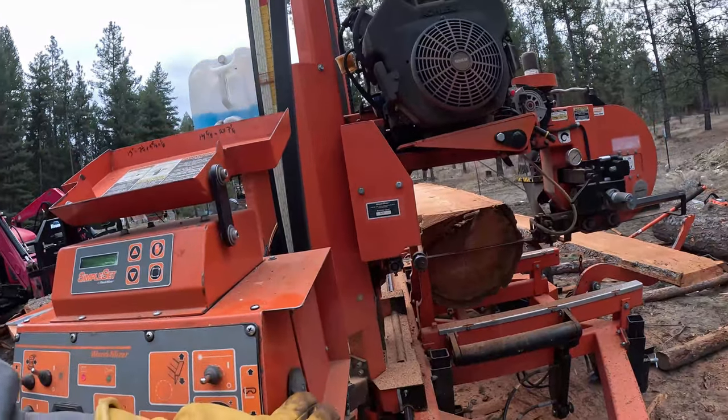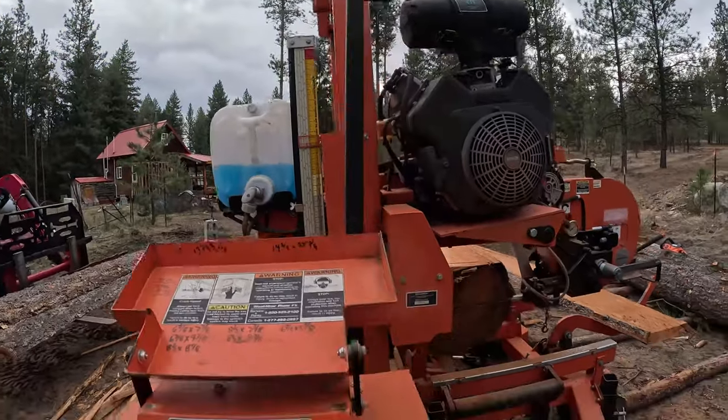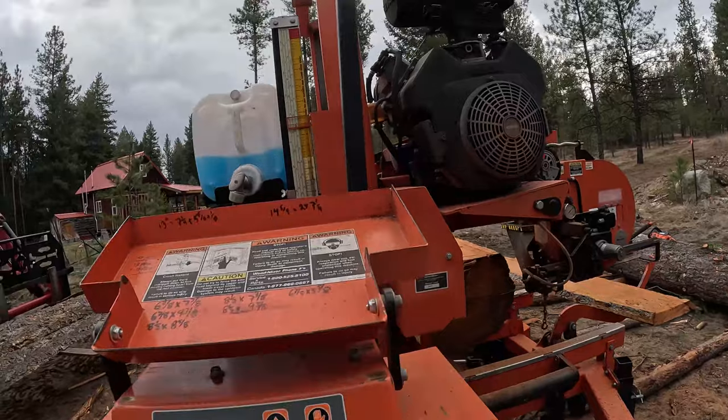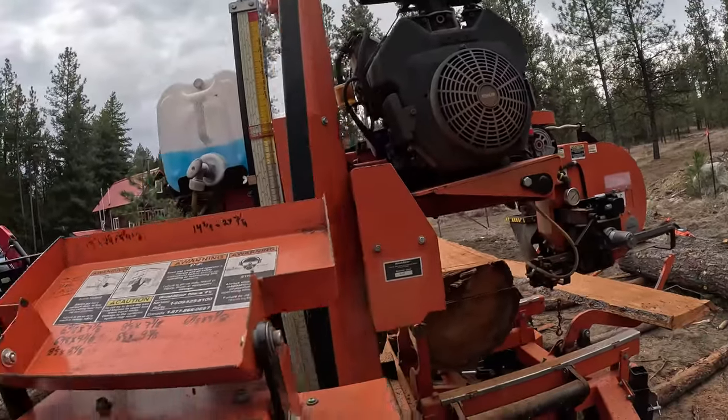One of the things that you've probably seen Kevin do when he's milling in some of the videos that I've done is something that you can always do, and that is drop your head down and look up there, and you see that I'm at 9 inches, and down there, that's the pith right there. So the other side's at 10, so I need to lower the other side about half an inch, folks. So I'm gonna go ahead, lower the other end, that tow board roller, because I dropped it and then put it back up. Lower that about half an inch to get this level again, and then I'll go ahead, take that skim cut off to take out that little wedge that I accidentally created. It happens, folks. And then we'll keep going. All right, let's get her done.